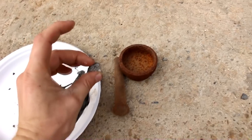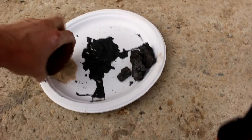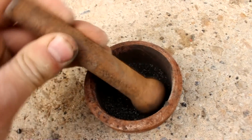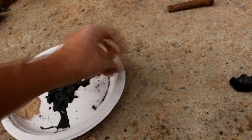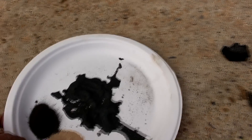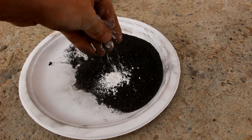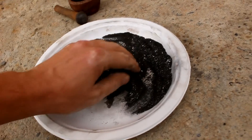I probably don't need much. So here's our limestone, which I'm just going to crush up using my pestle and mortar. Now let's crush up the impure carbon coke — I could probably also use charcoal, it's basically the same thing. That's actually probably all I need right there. So there's our iron recipe: magnetite, crushed limestone, a little bit of carbon. Let's get these mixed together. It's going to be a little wet at first, but the furnace will dry it out no problem. Just to cheat a little bit, I'm going to add in a little bit of soda ash — this will help react with any residual silica that may be there, make it more fluid, basically turn it to glass.